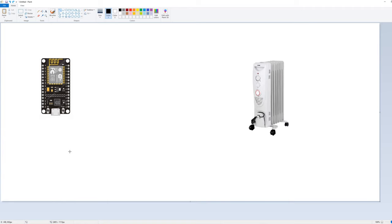I'm going to go ahead and draw up the schematic for this thing. It's pretty simple, but there's a little bit of circuitry involved because the microcontroller cannot directly drive the mechanical relay. So I've got the microcontroller, which in this case is a NodeMCU board based on the ESP8266 Wi-Fi chip. And a list of parts used in this project can be found down in the description. And the heater, let me just go ahead and draw in the relay real quick.